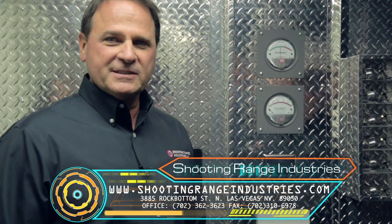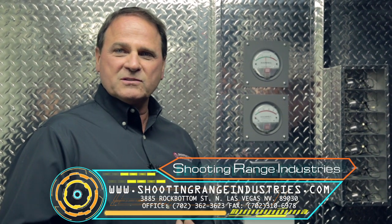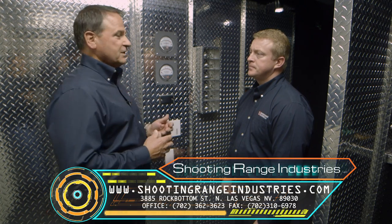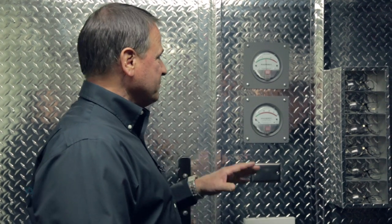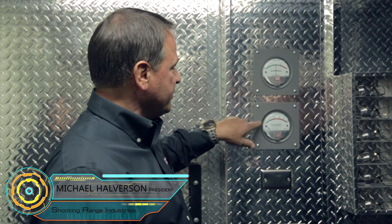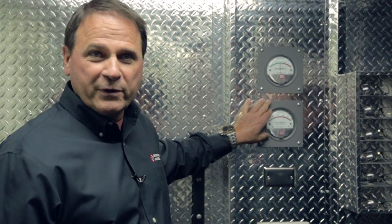So as we mentioned on the HVAC system, we have MagnaHelic gauges. We try to make these ranges as foolproof and as user-friendly as possible. So to ensure that the customer always knows that their operation of their HVAC system is working, these MagnaHelic gauges are how we can tell that's taking place. So we want to have a negative pressure inside the range, which we're measuring here. If this goes into the red, we know that we either have an exhaust fan or the HVAC supply system that isn't working. So this is a nice way to tell that we have a negative pressure inside the range, which we want.